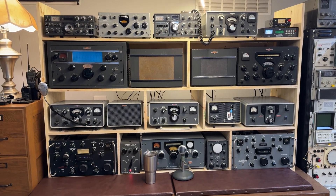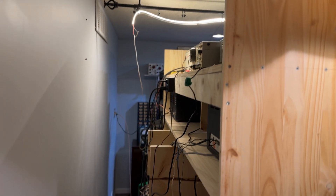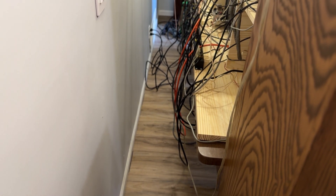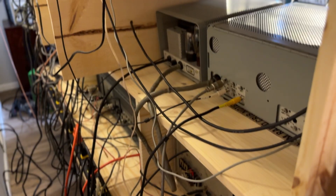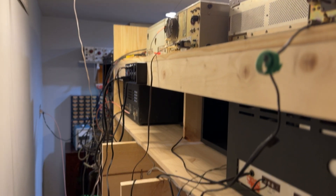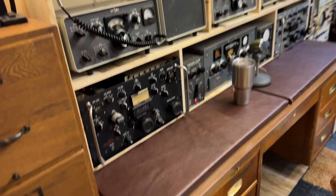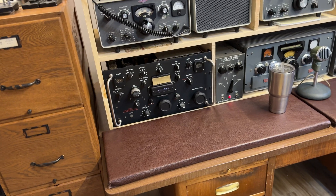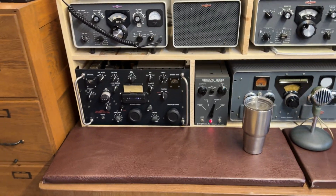That's how I spent my four day weekend — building this. And the best thing is that I've got room in the back to get to all the cabling and everything. I decided I wasn't going to shove it all the way against the wall — I wanted to be able to get in behind and do my stuff. Got my power strip there, and another power strip up there that has an EMI filter, which really, really helps cutting down some of the noise on the power lines going into these radios. It makes a heck of a difference — it quieted them down a lot. You can't hear the air conditioner kick on anymore because you used to get that noise. Not anymore, it's all gone. Works great.